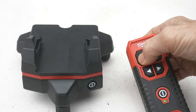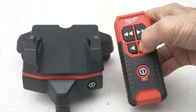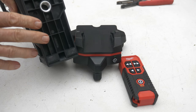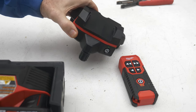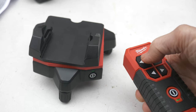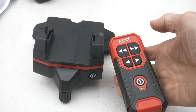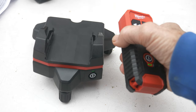You take your remote and turn it like that, then go back and go slow. This is my Milwaukee laser — this is the M12 version — and it slides in right here. See this groove there — it just slides right in. You can operate the remote by just clicking it, or by a long sweep. The click is 3/32nds of an inch at 100 feet, so your laser line will move 3/32nds of an inch at 100 feet.